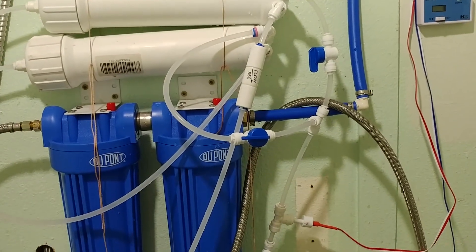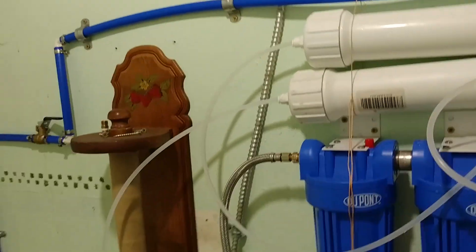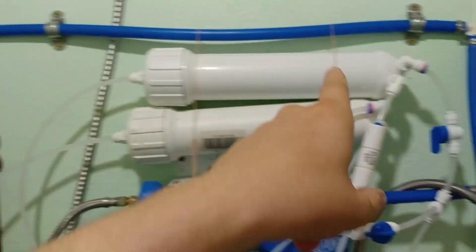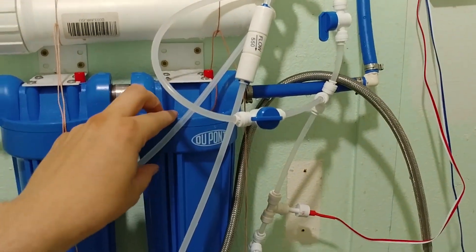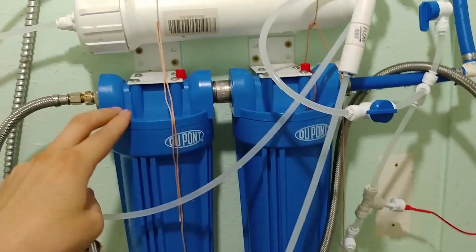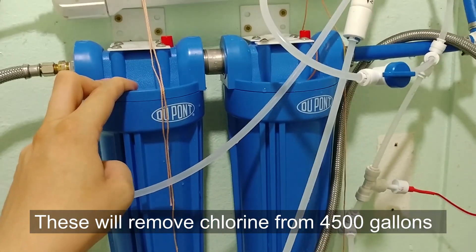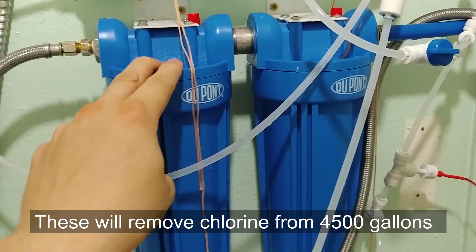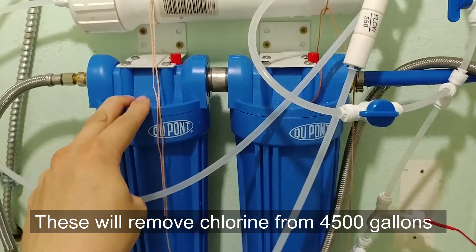Let me show you my setup — it's pretty messy because this is the utility bathroom and nobody ever comes in here. The whole room is plumbed in PEX where I've got a master shutoff. It runs around to my sediment filter, which has that white 10 micron sediment filter I showed you earlier. From there it goes into a 10 micron charcoal filter. I take these out once a month and swap them every four months.